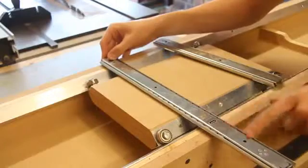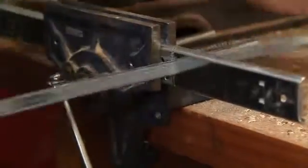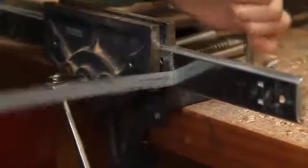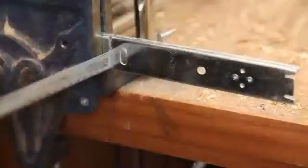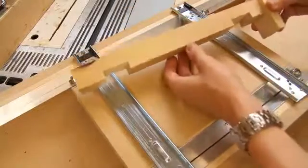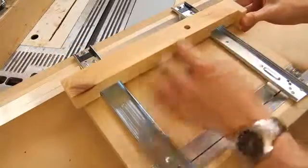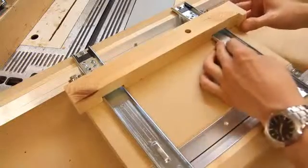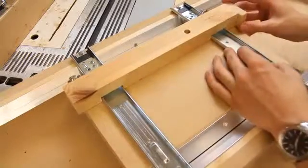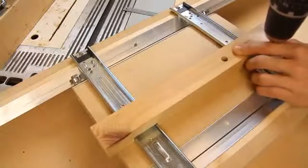Because I don't want a big overhang at the back, I'm cutting the drawer runner shorter, as you can see with this first one. To help with alignment of these drawer slides I've put together a small jig which references off the side of the carriage and helps position the two drawer slides — I got this idea from Matthias Wandel, so thanks to him.